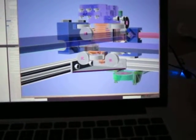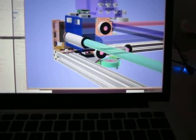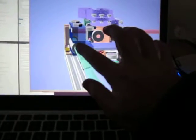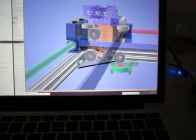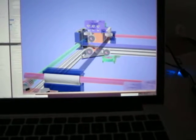But you can see the height differences in these two. There's the one belt the bearings are there, and one belt the bearings are there. And the X and Y rods with the linear LM8LUU bearings have had to go offset by about 12 to 15 millimeters there. And I've set the X rods at the same height here. The square rods, they're exactly the same height. Centers are on the same level as their corresponding fixed rods with the linear bearings.